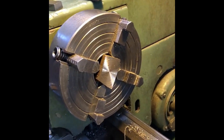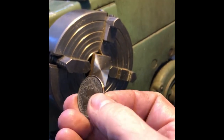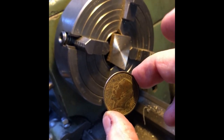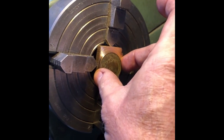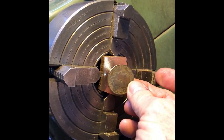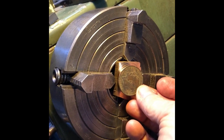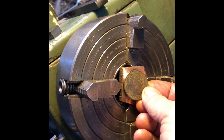First up I'm going to do a little experiment. In the final project I have to inlay a penny — an old penny. This is a George penny of 1913, because it's a similar sort of age and presumably a similar alloy. In the final project I have to inset it into a piece of brass. I've got a scrap of brass here, and I'm just doing an experiment to see what the recesses look like and how to machine it. Then I'll inlay it in the socket, solder it, and check that it's watertight to make sure lighter fluid doesn't leak out. I'll probably drill a hole in the middle and put it under compressed air under water to make sure I can make an airtight seal.